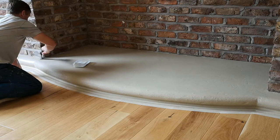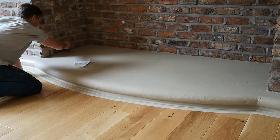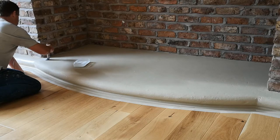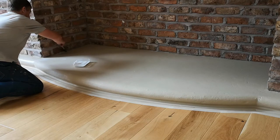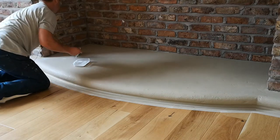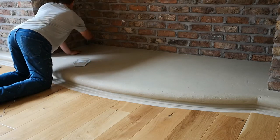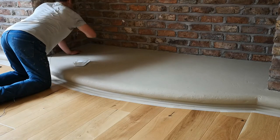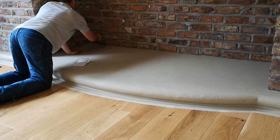Then you ensure that the tips of the bristles are up against the adjacent wall there, just against the corner. Drag it along. You only need to drag it down one or two times. So I went up to the border. I've done a second parallel application next to that first border, and then I'm going to cut into the corner right there, right into the corners along the border, second parallel line like this, and then I'll start doing the back over here, 45 degrees, carefully.